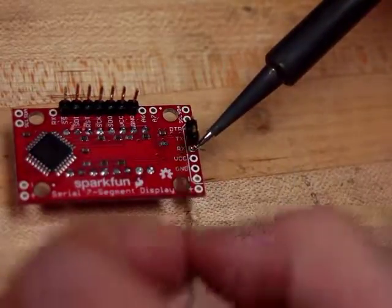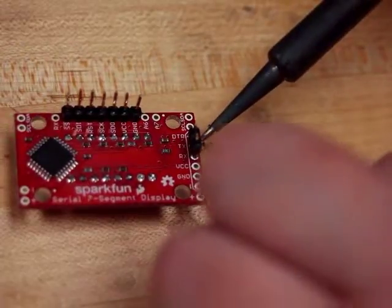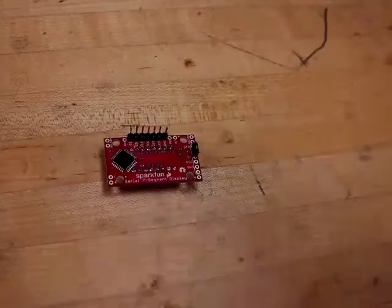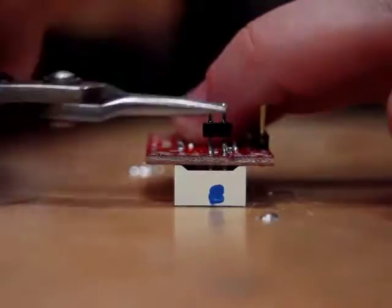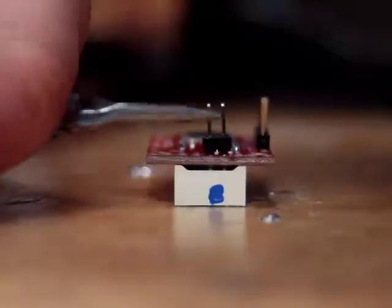This technique is helpful while soldering, but when you try to plug this into a breadboard you'll find the short ends of the pins are not quite long enough to make a connection. But that's okay — we simply need to slide the divider down to add some length to the pin. Sometimes it does take a little bit of force, and there we go.